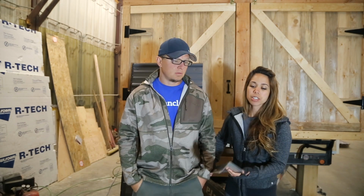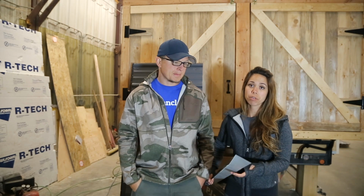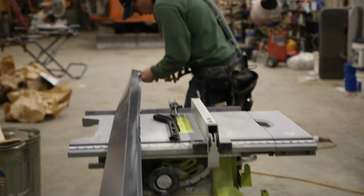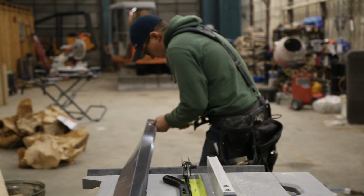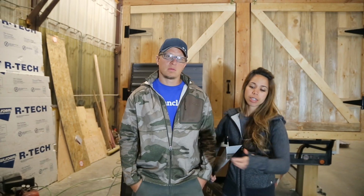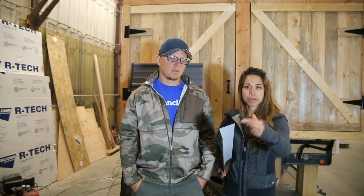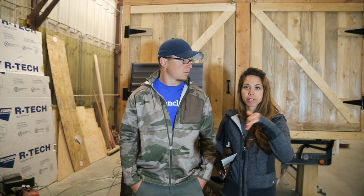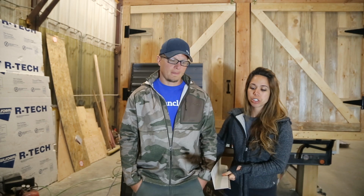One of the tricks that we do is we have all of our roofing ordered from a metal shop that's local to us, so everything is cut to size. And you can see that there's an angle here that's not 90. I believe this is the 2/12. So we have the 2/12 pitch on this, and then where there is not the dormer, we have a 7/12 pitch cut into the Eave Flashing.